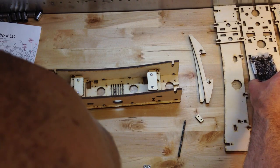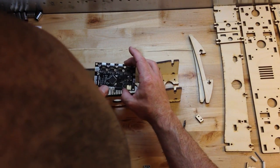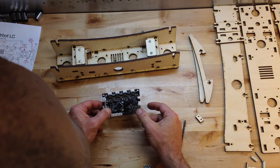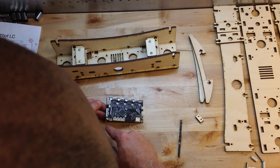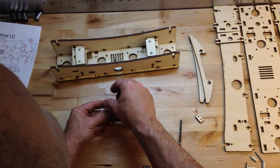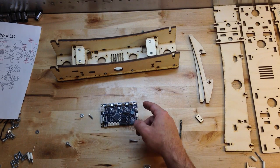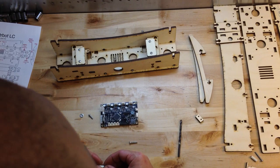These are a little tricky. This board — it's kind of a weird thing with it. You've got three holes here that a 6-32 bolt fits through, and there's enough clearance where you don't have to worry about hurting the electronics — you'll be fine. Those fit on all three of those. This bolt does not fit through that hole — it just doesn't go. I've heard people say they meant to do that so it orients properly on the machine and you don't put the CPU in upside down.